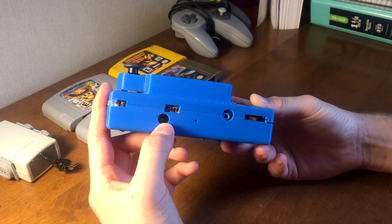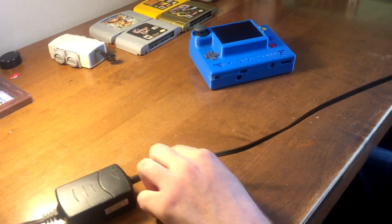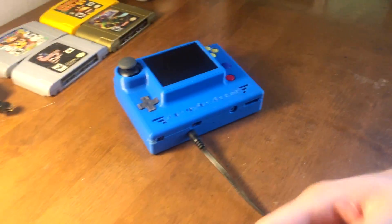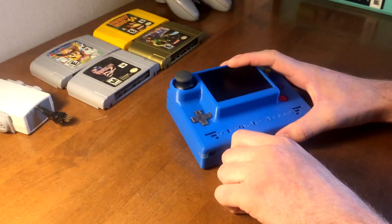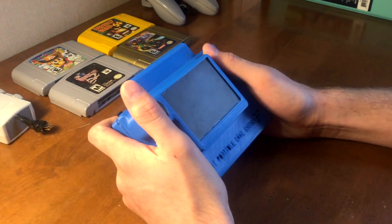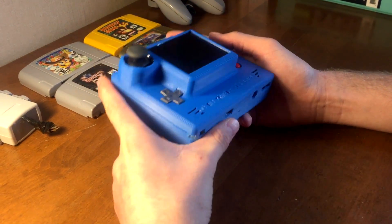This is the charging jack, so this is the charger right here, and it has a little LED indicator — it's green when it's not plugged in and it turns red when it is plugged in. It takes about 4 or 5 hours to charge fully, and the battery — I have two 3.7 volt 2,500 milliamp-hour lithium polymer cells in series, so that gets it about 2 to 3 hours of battery life on a single charge.